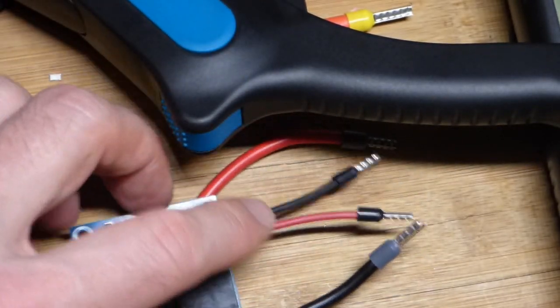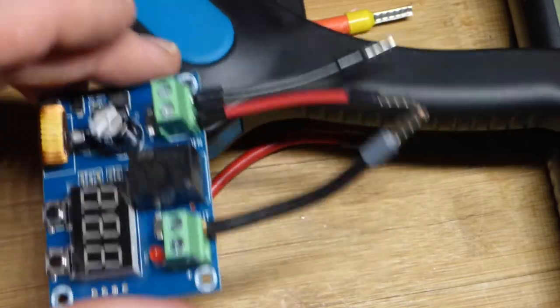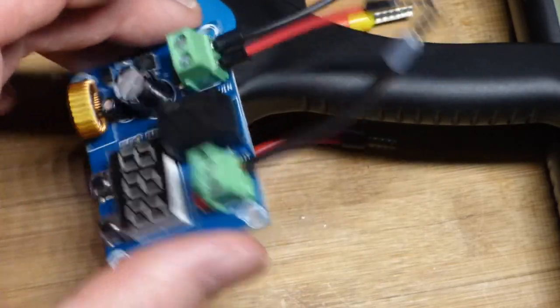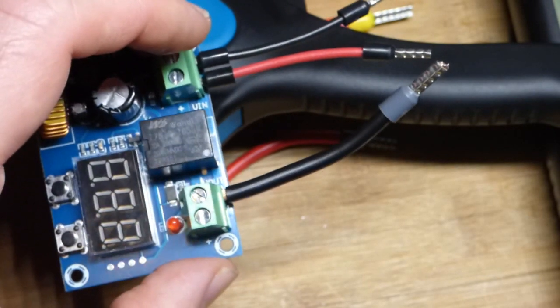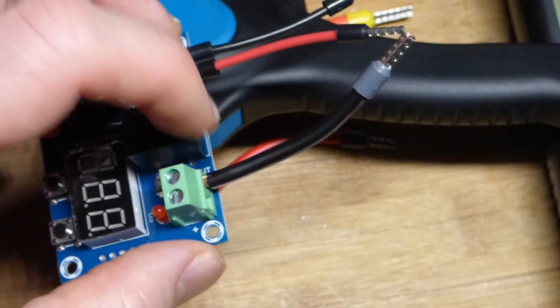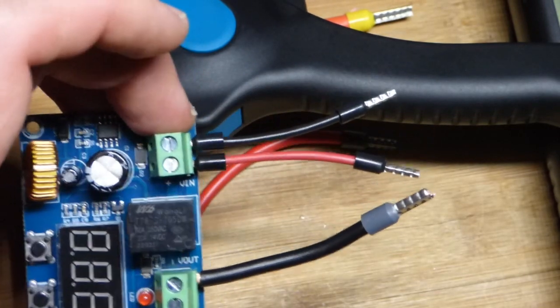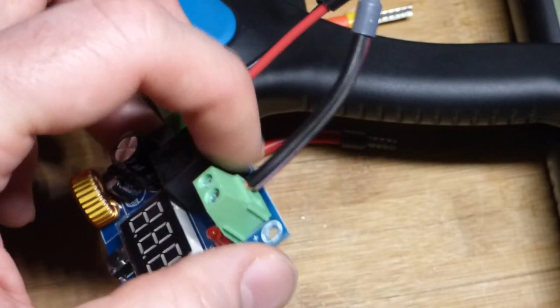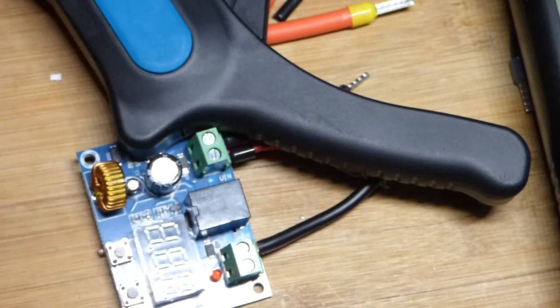That's a 16-gauge right there from an earlier video. 12-gauge is much bigger. 14-gauge, I'm guessing, would fit — that's probably the maximum you could put a ferrule on and fit it in there. Just putting the bare wire in there is just fine, just make sure no strands are sticking out. That's something you generally do if you're going to leave it in permanently. The ferrules make it easier to remove and reinsert the stranded wire — it's going to get all mangled up just trying to put it in the first time, and definitely if you yank it out and put it back in, you're probably going to mangle it. This video went on a lot longer than I expected, but I hope you enjoyed. Make sure you check out one of the other videos posted to the screen and the links down below. I'll see you in the next video.